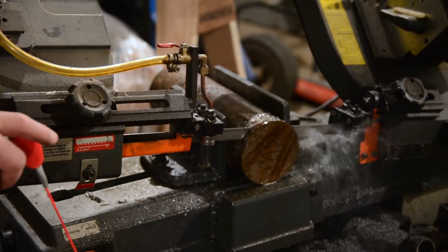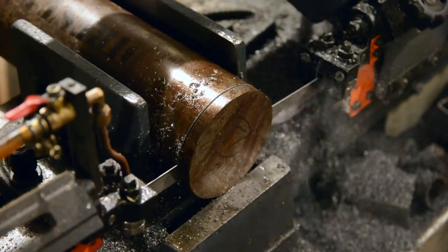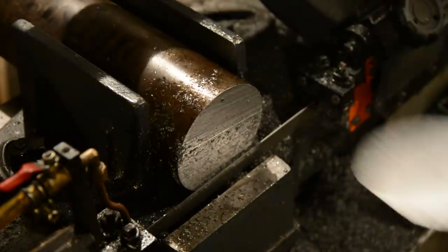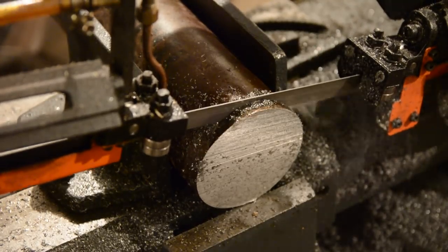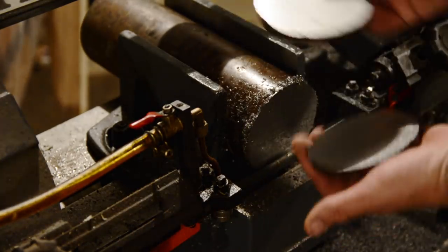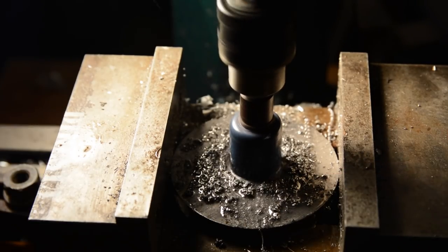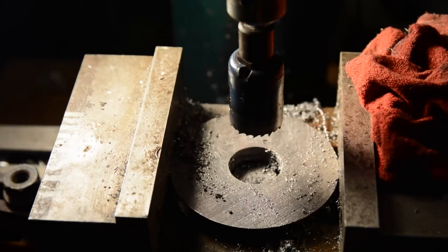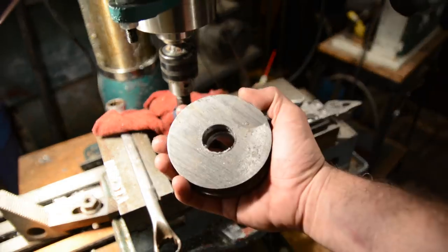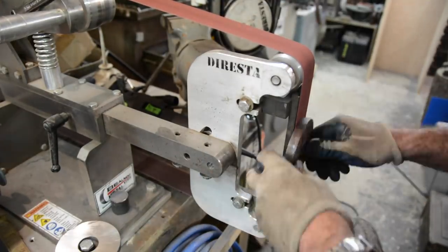Now I'm jumping to metal work. This is a four-inch chunk of steel stock that I had, and my band saw cut it quite simply — I didn't expect it to go as smoothly as it did. The saw shuts off automatically once you pass through. Then I cut the second one — the oil pump wasn't working for the first pass, so you see me spraying oil on it; the second pass I got the oil pump working. This is going to be the truss rod — I'm cutting off the piece that isn't needed.